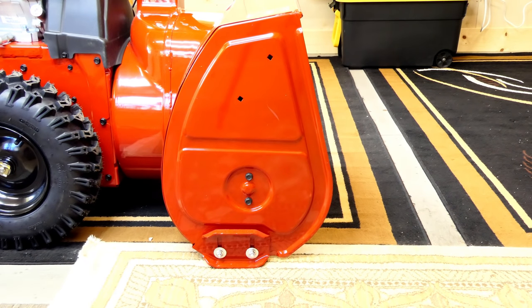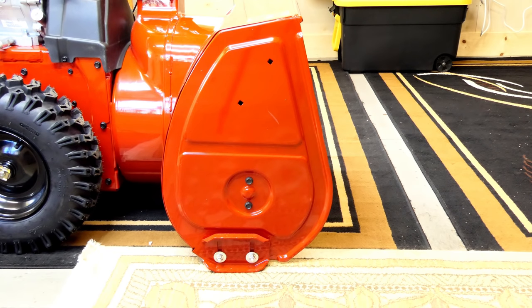Let's talk about a new design change. If you notice, the front of the auger housing is not straight up and down like the old models — it's rounded in the front and then tipped back at the top. What that does is, if you have snow drifts taller than the auger housing, this allows the snow to drop down in front of the machine and into the auger assembly easier. You won't get snow that just runs over the top of the machine and gets you stuck. This slant-back auger housing is a better design than what they had in the past. It's a minor change, but it does make a difference if you do a lot of drifts.